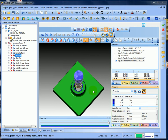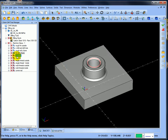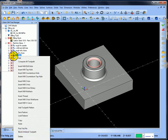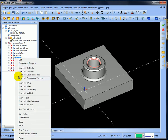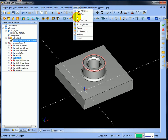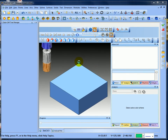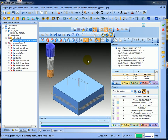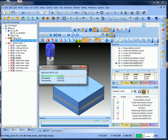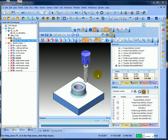Let's run the chamfering tool - post, post. That turns them on. Go into modules simulation, go down the list to the chamfer mill, and turn that off. So what it's going to do now is put the inside chamfer and the outside chamfer, which you can see is done.